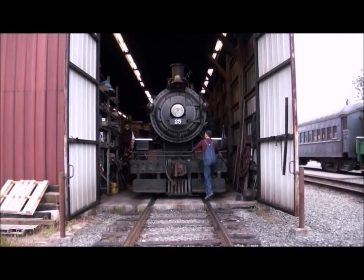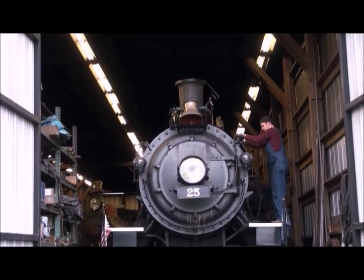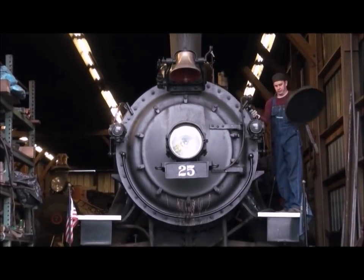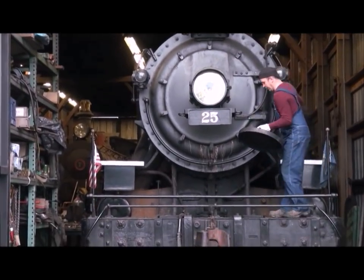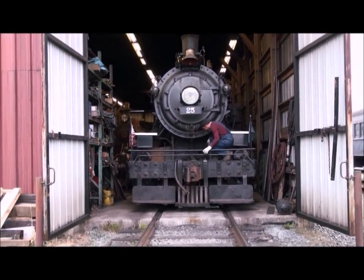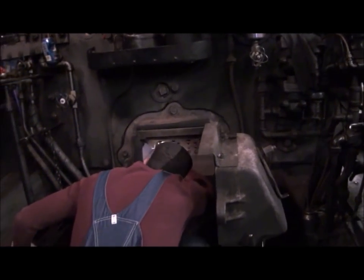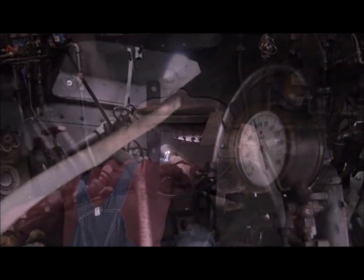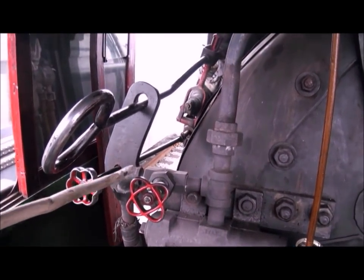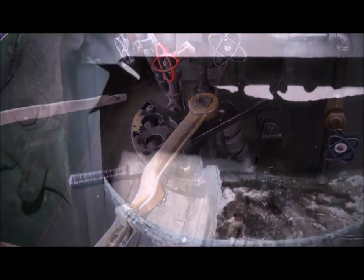The next thing is you've got to go up and take the stack cover off. Most people who have been a fireman for very long have at some point forgotten this stack cover — and what a mess that is, you'll fill the place with smoke everywhere. You'll notice Ryan is putting the smokestack cover right here onto the locomotive — we like to take it with us so just in case we have to shut down someplace, we have it. The next thing you want to do is check inside of the firebox — you're looking for any leaking stay bolts or cracked or broken fire bricks. Look around good, make sure there's no problems in there.